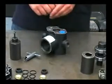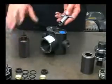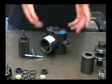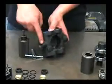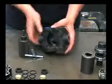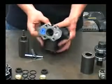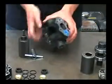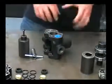If you do need to remove the valves, there are special tools listed in the owner's manual. If you don't have access to those, you can remove the parts with needle nose pliers and a screwdriver carefully. Make note of the orientation of the valves: on the inlet port, the valve will have the cage facing up — all four are the same. On the outlet port, you'll have the seat facing up. On the opposite end of the pump, the inlet port has the cage facing up and the outlet port has the seat facing up. Make sure to reinstall them in that orientation.